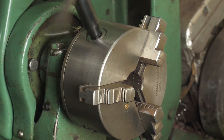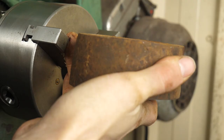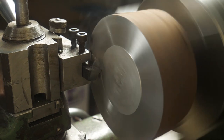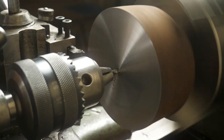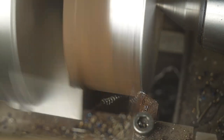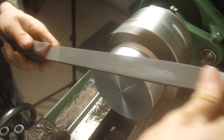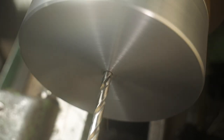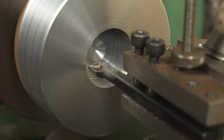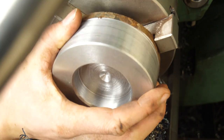We'll have to switch over to outie jaws today. I found that one of the ends of this stock was heavily deformed — this wasn't too much of an issue, I just had to keep cutting until I got into more round and true material. I drilled and then progressively bored the hole out bigger, just so I can clear the boss in the middle of the accumulator. This part of the tool needs to slip past an o-ring so I put a generous bevel on here so it can't snag on that o-ring.